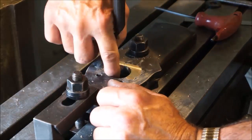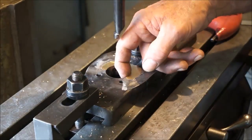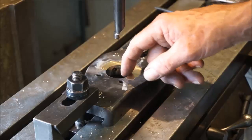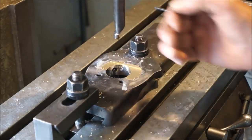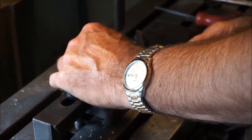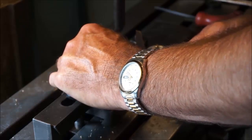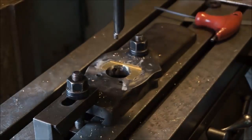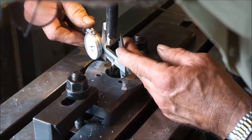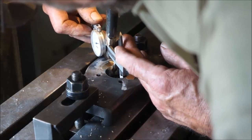That's feeling real close. I can feel more of a lip over here than over here. Our readings are still 0, 0. Okay, but now I'm going to reach on over here closer and see if I want to shift this X and Y in any one direction here. Okay, as close as I can go around here without touching that other brass right there, I've got 365. And when I go across this direction over here, yeah, like 369, 368.